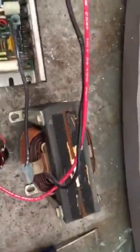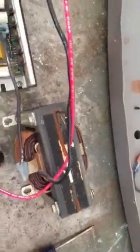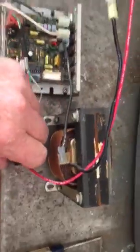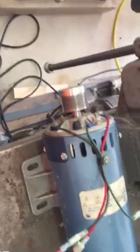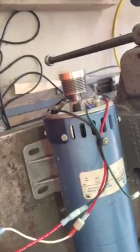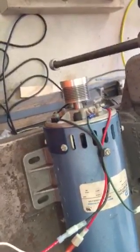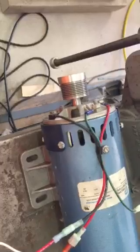I'll turn it on. The only potentiometer I had was 500K, so it's way too big. It's kind of funny that it starts up slow — I don't know whether it's because the potentiometer's 500K and it takes a while to get going. But it does get there.